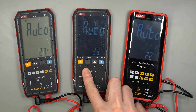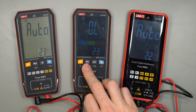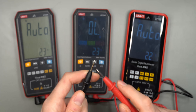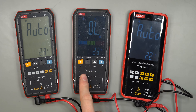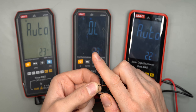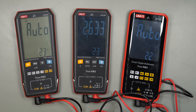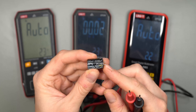The B model has selectable modes: DC, AC, resistance, selectable continuity, diode, and more. The selectable continuity is noticeably faster than auto mode — much better with good test leads. The diode tester gives a beep confirming the diode is good, and it will actually light up an LED while showing the forward voltage — for example 2.6V — confirming the LED works. Capacitance mode is available too, though not fast.